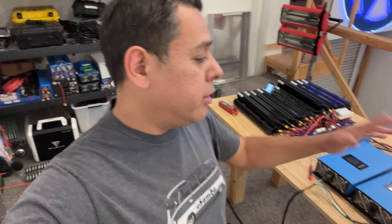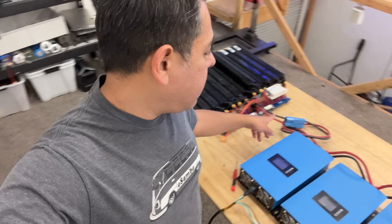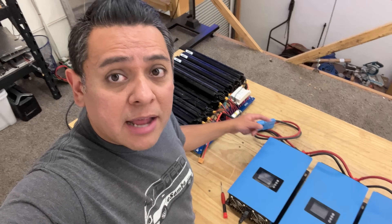So that's just one way you can do pre-charge — you use a variable voltage power supply, charge the caps, then connect your battery slowly. Another way is to connect the actual battery but not directly — you use a resistor, and there are a couple of other components you can use for that. But for right now, this is the one I can show you. If you were wondering how to eliminate those sparks and not destroy your high current connectors, pre-charge your caps. That's what you have to do. Thanks for watching, see you on the next one.